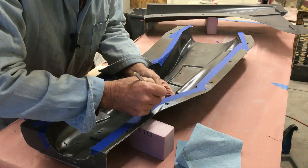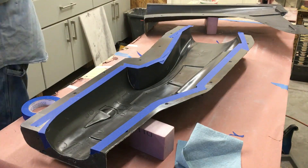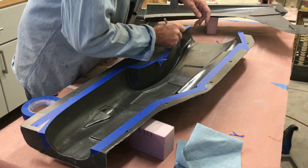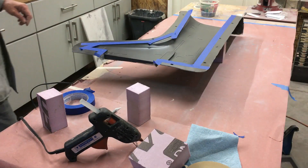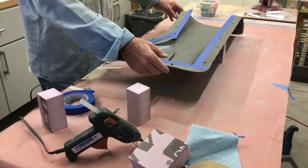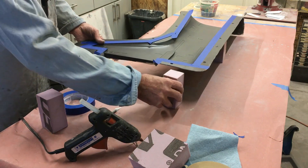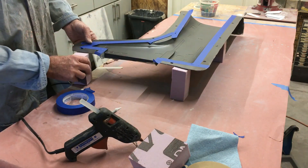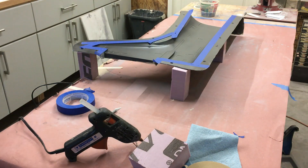Just make sure that you don't let any tape go onto the aircraft side of the mold — leave it on the parting plane but don't let it go below the parting plane on those edges, because that will cause a bad joint. While I was taping up this tail, I realized it was a little rocky, so I'm just going to make a quick fix and temporarily hot-glue a couple of blocks to the end so it's nice and solid, because trying to lay up a mold when it's rocking back and forth is just a pain.